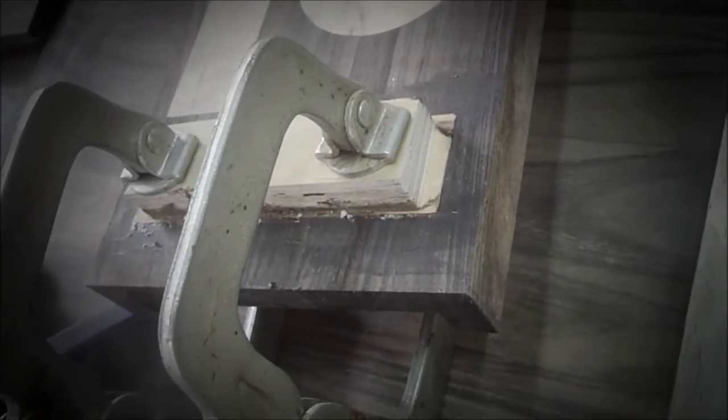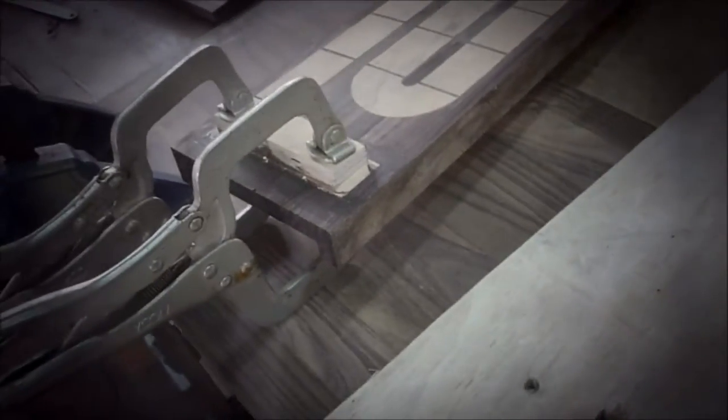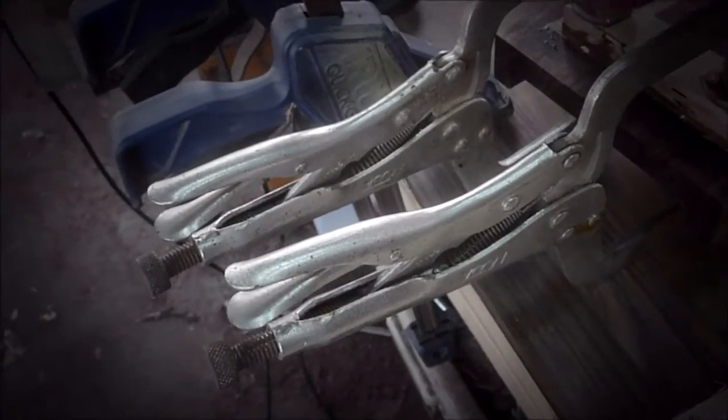And you'll notice too, I'll be removing even more from here, so that would make this end grain really weak this way. It would want to cup or bow, but we've sunk in 3/8 worth of, or say almost a centimeter worth of cherry in there, and that's where they keep score. And the cross grain of that wood will stabilize the end grain of this wood.